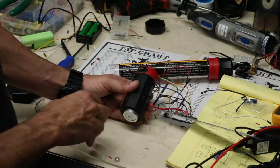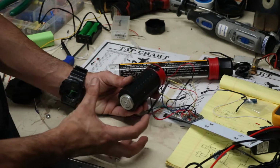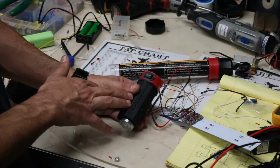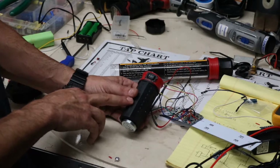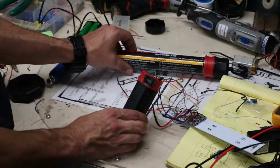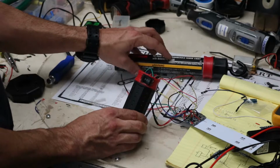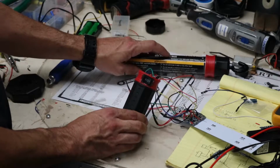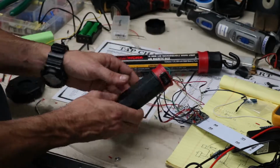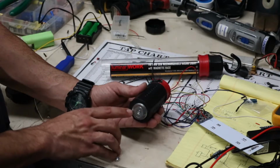So now this is, I think, a great improvement over what it was. I've done away with that big end down here. It's got a much more improved battery life on it now. It's got about 2250 milliamps at 8.4 volts versus the 7.2 volts at 600 milliamps that came with it. So we've almost quadrupled the total capacity of this unit and reduced its size considerably because it doesn't have that big end down here. So I took the magnet.